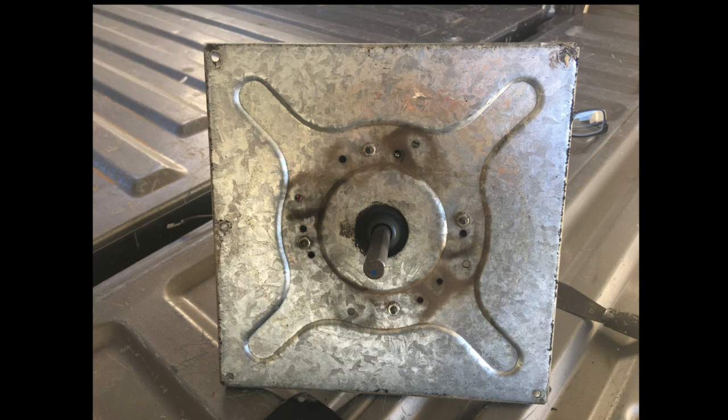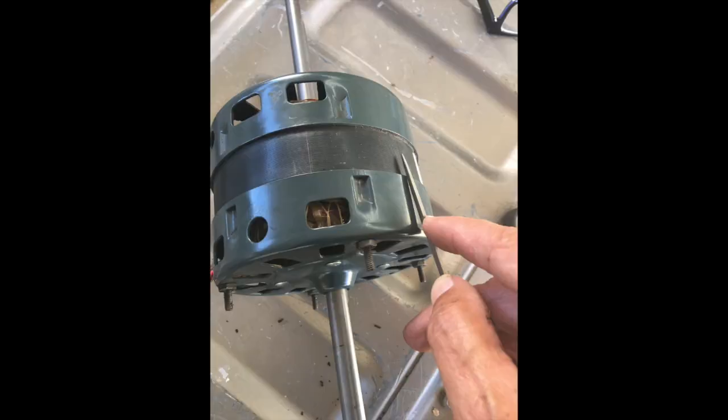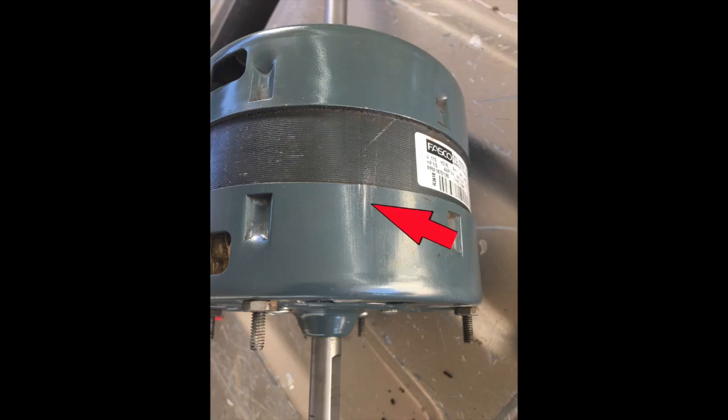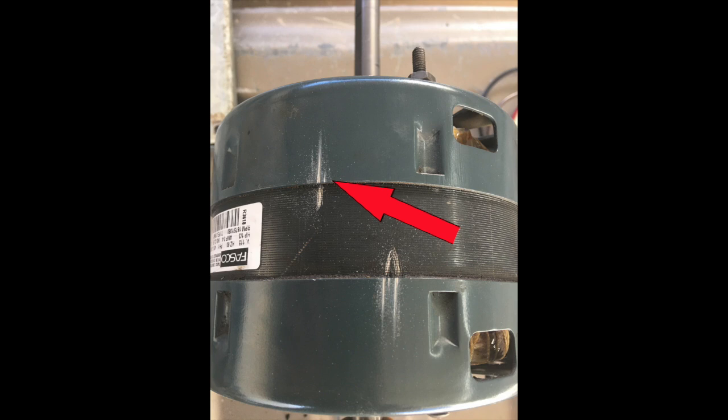Both the motor and the plate were dirty, and I used this to clean off the outside of the motor because it was oily and greasy. I took a small file and used it to score marks onto both parts of the now-clean metal housing of the motor. The reason you do this is so when you put the sections back together, these marks line them up so you can properly reassemble them. If you don't have a file, use whatever is handy — an awl, nail, screwdriver, end of a screw, a magic marker, whatever.